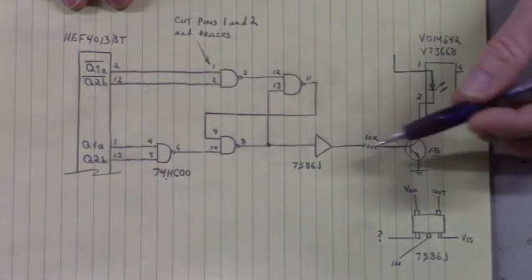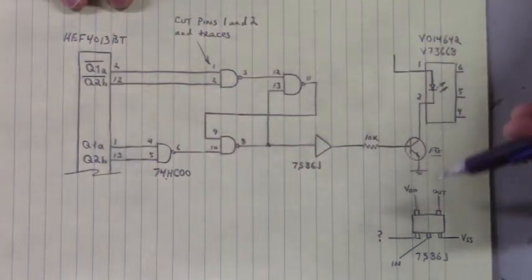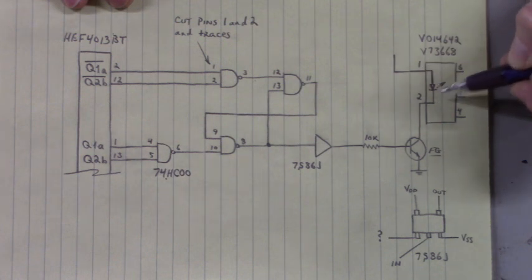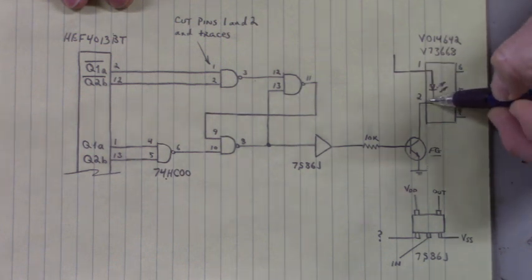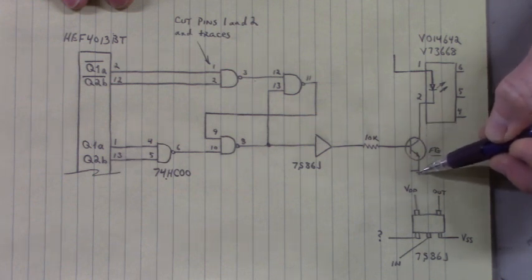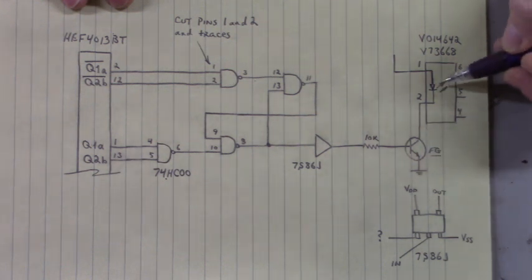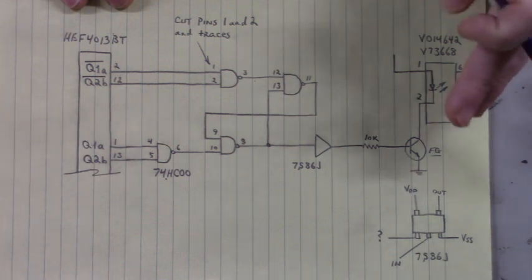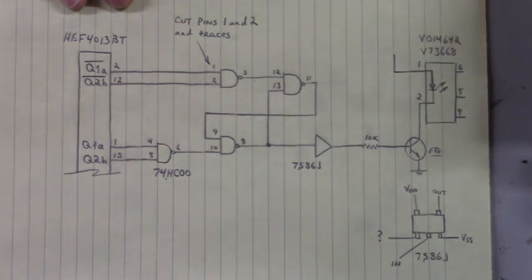When the transistor is turned on from this circuit, current flows through the LED, emitting photons, through the collector emitter junction to ground. The photons are emitted into the phototransistor of this optocoupler. And the final stage is connected to, looks like, wiring.